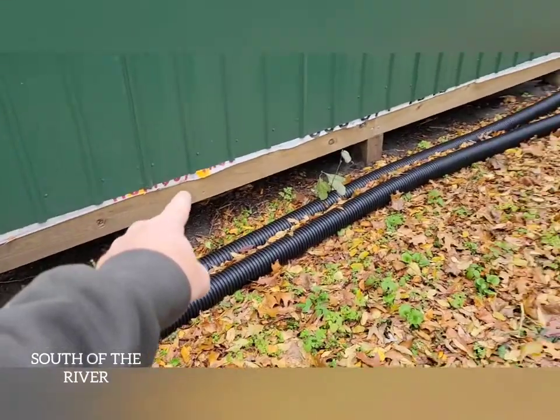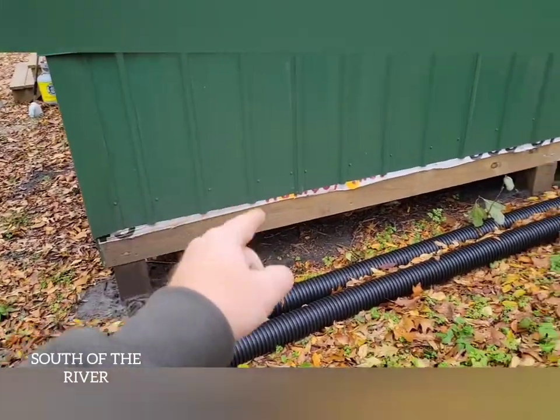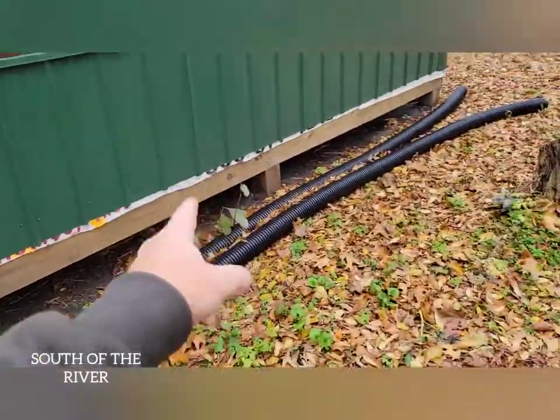On this bottom plate here that my floor system sits on, I want to cover that with trim. I have it, I just got to put it up. It's not a big deal, those are treated, they'll be fine, but I want to put a piece of green metal all the way across the back of that, just to cover it up so the rain doesn't hit it, and also put a front gutter on with a downspout.